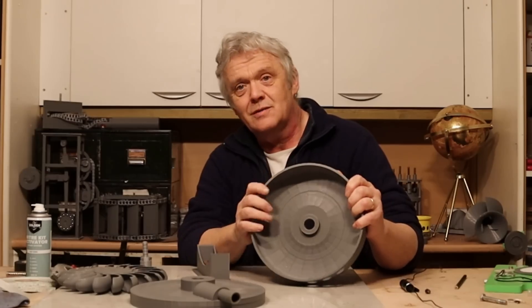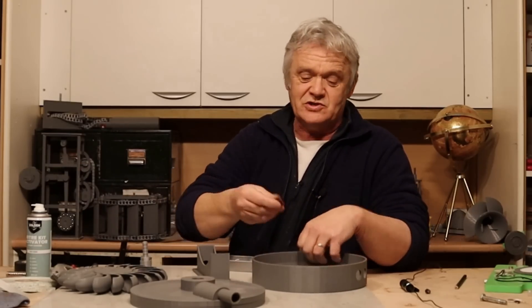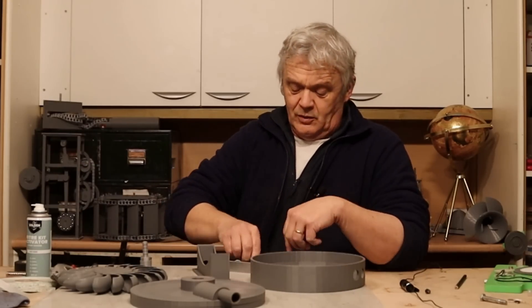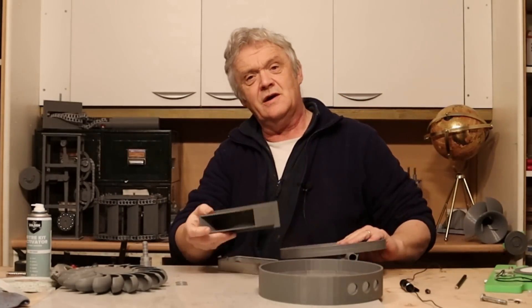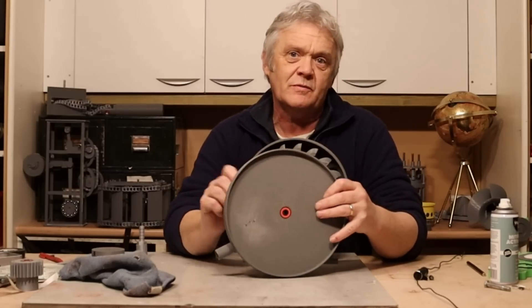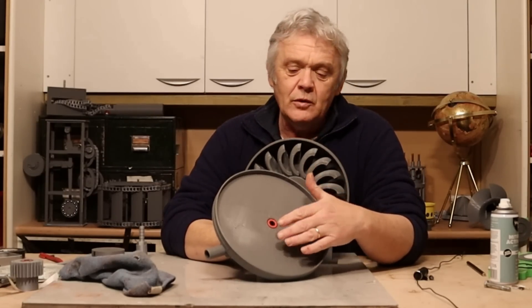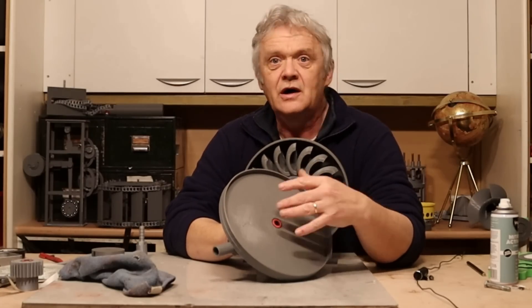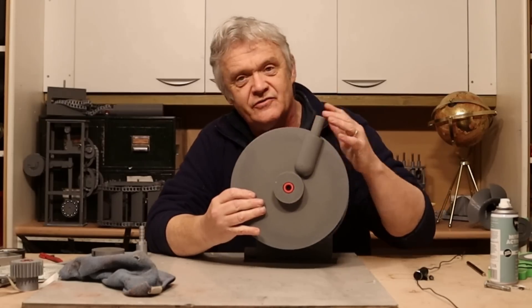They take an 8mm piece of bar. I'm going to stuff some bearings in — two here and two in here — then glue the foot on. You'll notice there's an 8mm washer there. It's standard practice for me to put an 8mm washer in, because when we press things together it presses against the inner race of the bearing and won't lock against the housing, allowing it to spin freely.